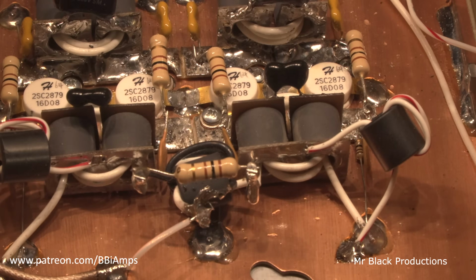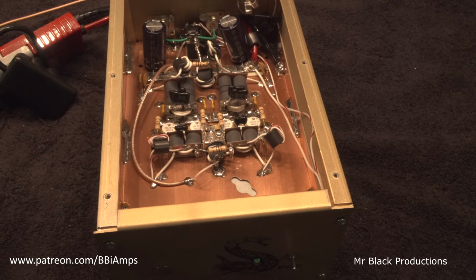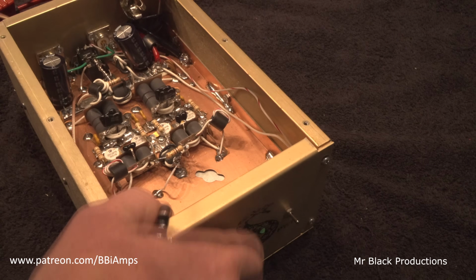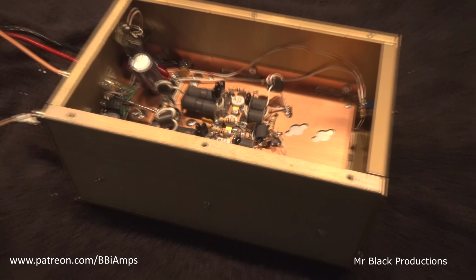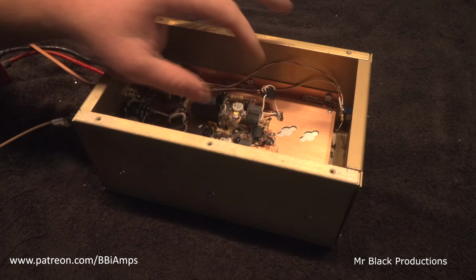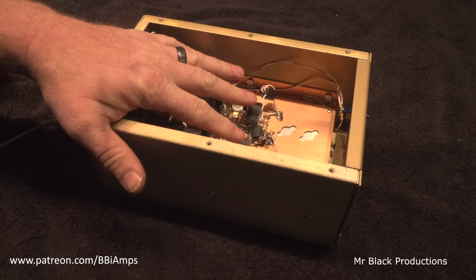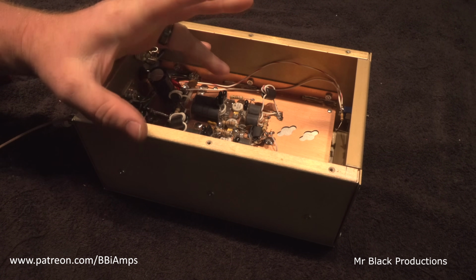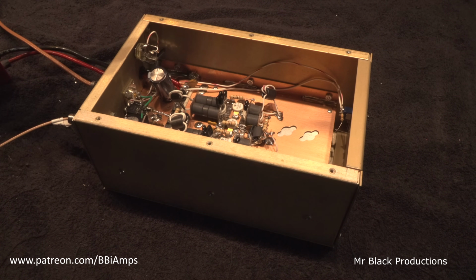So that made me go, this is new. There's someone new in the game. So I called a couple of my cohorts that live on that side of the planet, and I said, hey, I got myself a Davemade here that has got no tuning on the input network whatsoever. It's got 1,000 pF on the input transformers. It's got like 490 plus 500 pF caps on the outputs. The transformers are wrong. And the way this box is laid out is in a configuration I've never seen Joe do. Did something change? And the answer immediately came back was yes.